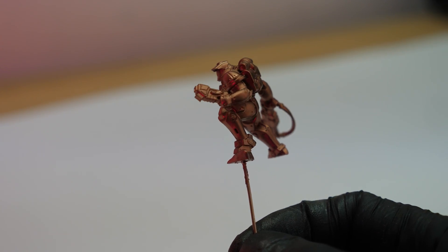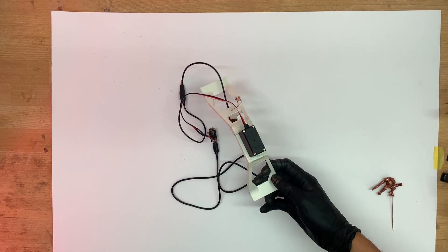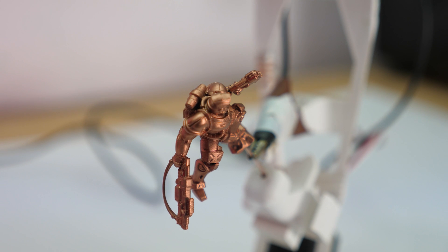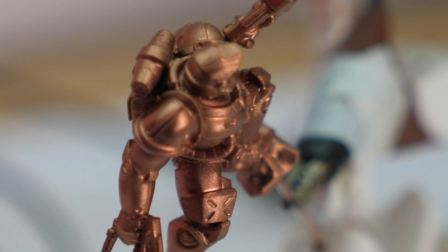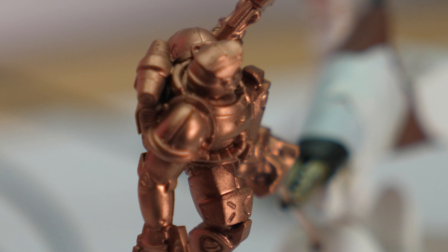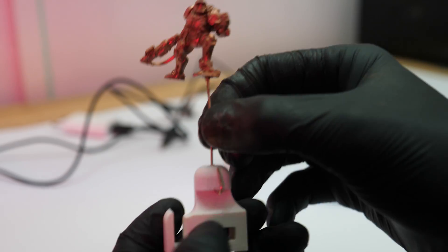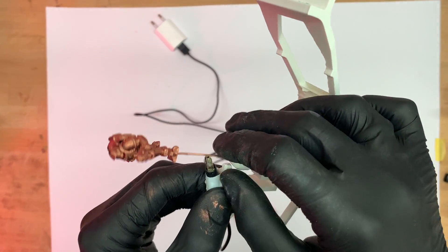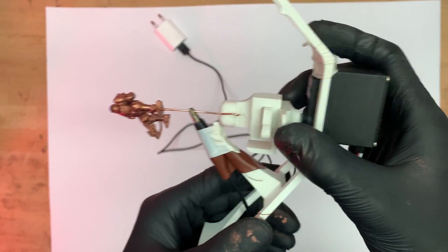Also seal the joint with undiluted copper paint. Now we have a miniature on a stick — what next? Let me show you a fantastic little device: the rotary jig from XenoArch. This thing rotates the parts being plated very slowly while they hang in the bath, which is a great way to prevent anode shadows. You just put your model on the adapter, bend the wire, and put the whole thing into the jig. Then connect it to the power supply and you're done. I'll link it in the description.